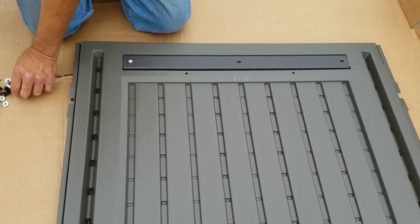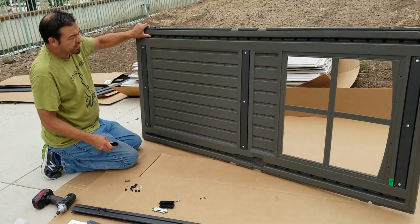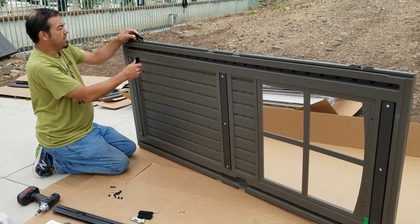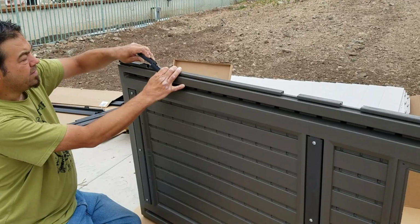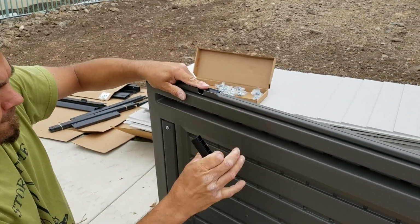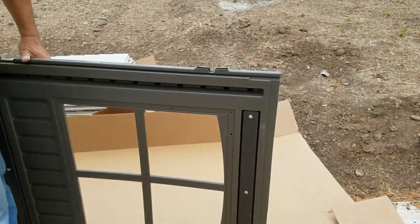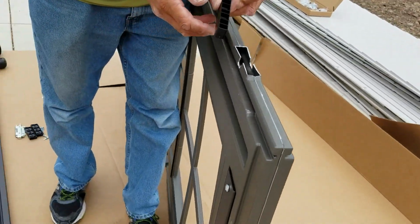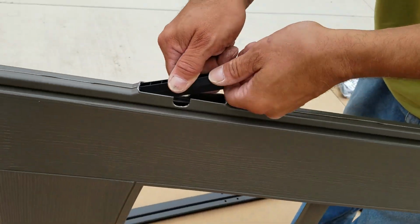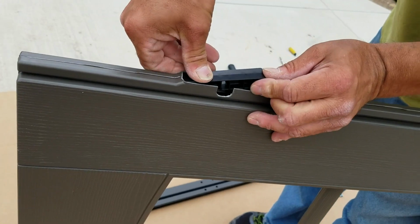If you want, a lot of times the book says put them on here, but it makes the door heavier. So if you're going to, especially if you're by yourself, which you shouldn't be, the instructions say always 2 or more people, you put these little blocks in, but you might want to leave those things off to keep the door lighter, and then you can always screw them on later in the door braces. So anyways, it adds weight to the door, it makes things a lot heavier.